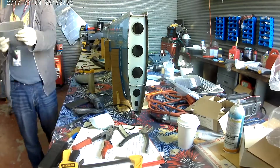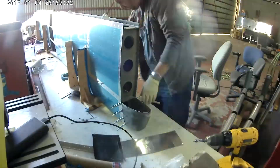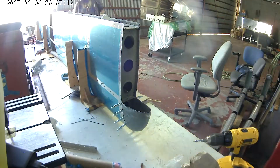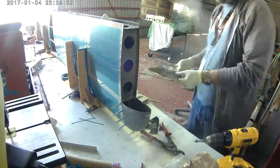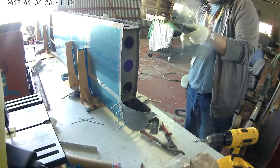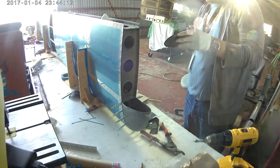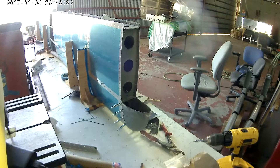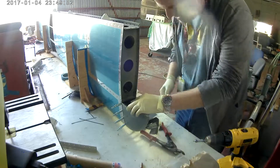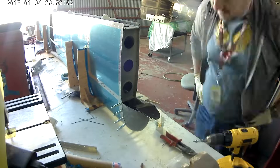Here you see me screwing up the other fairing by sanding it too much. I told you I had screwed one up — well, that's the one. I screwed it up hard, so I had to buy another one from Vans. You want an educational moment? Don't take material off. What happened was, when I sanded it originally to go around the curve of the fairing for the front of the elevator, it looked good and it matched. But it was a little wavy. So when I went to put the carbon fiber piece onto it, it wasn't a smooth attach point all the way across — there were some ridges. I went to sand it even, and by the time I was done I'd taken off way too much. When you put the elevator on, it just looked awful. Lessons learned. And these fairing tips ain't cheap.